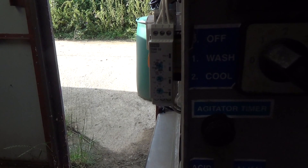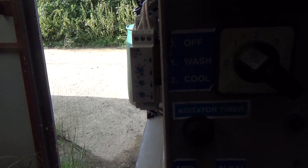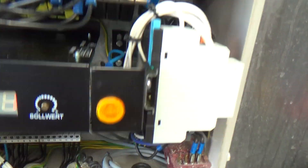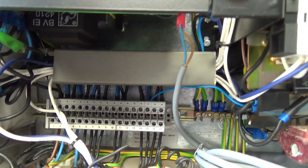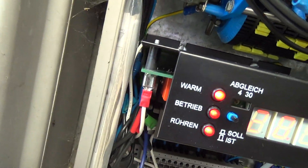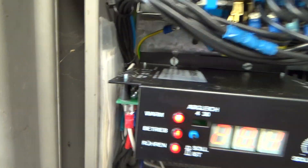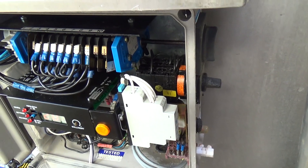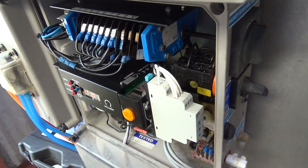They're handy if you want to use them for delaying start on the compressor or something. Anyway, that's the little timer — and then we've looped the wires round, running through the trunking, and we've joined it on there. We've left it so that you could unplug it and plug the original wire back on if this ever gave trouble. Although it's actually wired through a normally closed contact, so if it's packed up, it should still work.